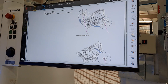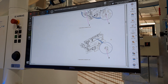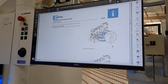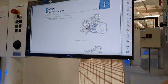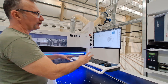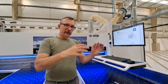You see here there is a nipple in front. On the saw carriage there are various points — like six points maybe — to grease. Each one indicates a point. You actually have to crawl into the machine or onto it. Some of them can be done from over here, and then if you close the machine, the operator can have the carriage travel to the other end. You can pull them back and grease the other side.